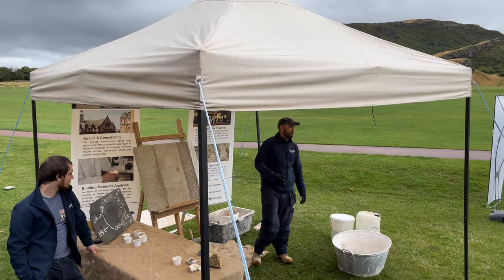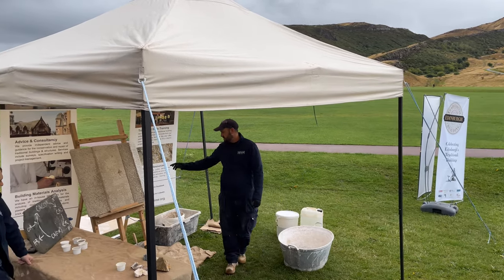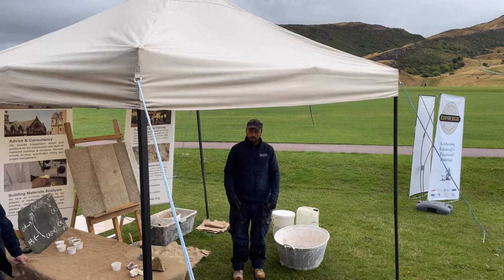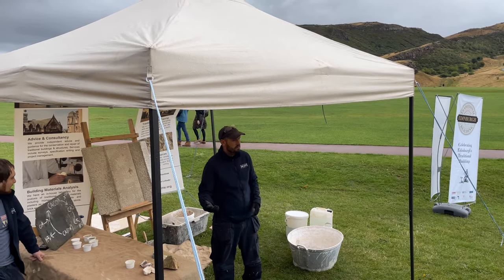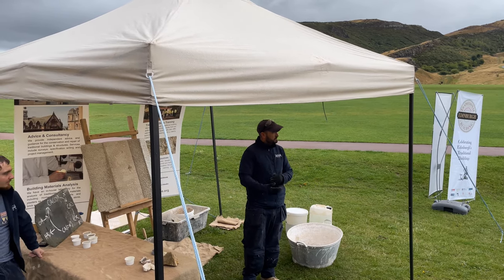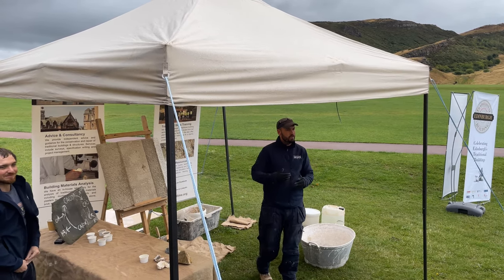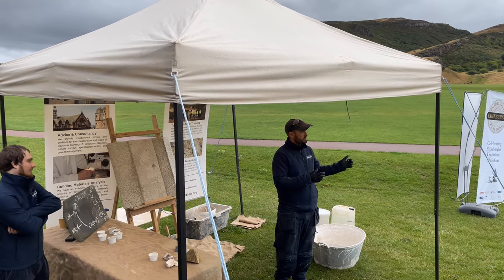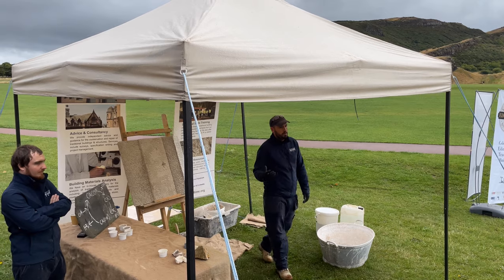Your finish coat is very similar to your first coat — a wet dash you're generally throwing on, single grain thickness. That would be your typical three-coat harling system. Harling comes from the Scots word 'hurling' — you're hurling the material at the wall. We introduced harling because we need that extra layer of protection on our buildings. The weather here is unforgiving, so we need that extra layer to reduce water getting into your building but also to increase the building's drying rate.